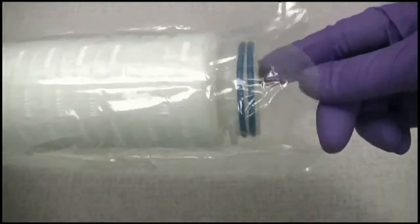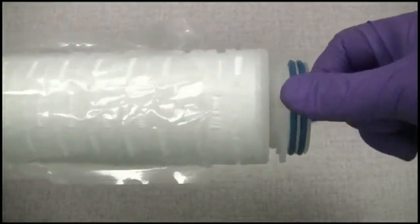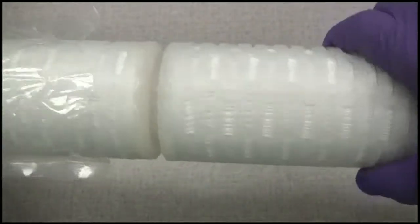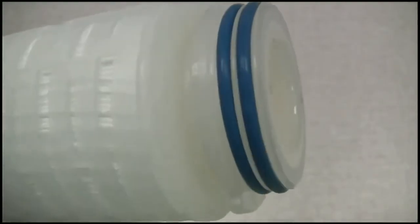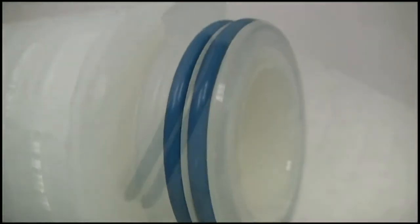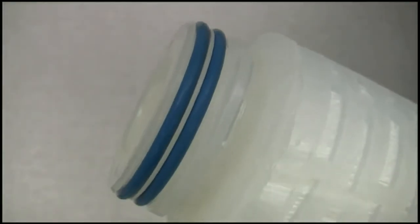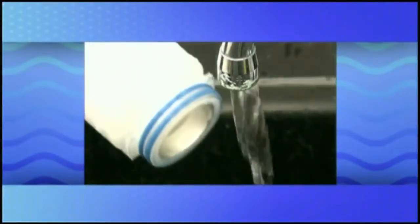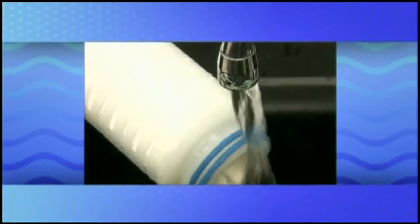Or, if easier, handle the filter with laboratory gloves and immediately dispose of the filter bags. Be sure the O-rings are not cracked, gouged, or deformed and they are properly seated in the filter connector grooves. When ready to install, first wet the filter O-rings for several seconds with sterile water, water, or isopropyl alcohol depending upon the application and customer regulations.